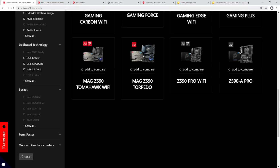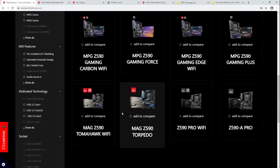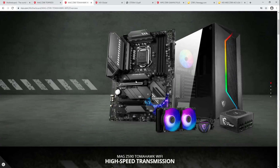And the neat thing with the MSI board is that MSI actually implements proper VRM temperature sensors, which some motherboard vendors can't figure out how to do. I mean, it's not like they don't have temperature sensors; they have them. You just can't access them through software. Can't access them with any software. So they may as well not be there. Until the VRM hits the over temperature protection and shuts down, that sensor is basically useless. But that's not an issue with MSI boards. So, yeah, this looks really solid.